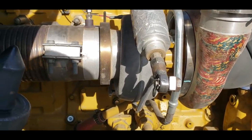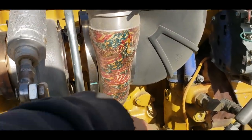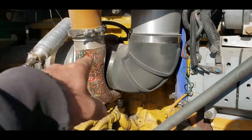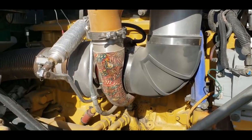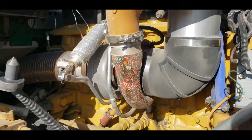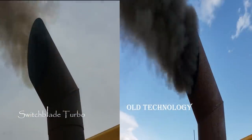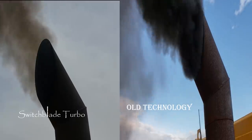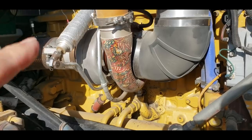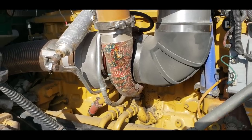You've got to be able to shove the air through this. This is a 1.32 A/R housing — it's a super core turbo, so this is the 80 millimeter compressor wheel. This thing really pumps a lot of air. I have this Switchblade on the C15, on the D9, and also on my 37. It's doubled the oil life of the 37 and made a completely different tractor out of the nine — it just gets up and moves, and so does the scraper.